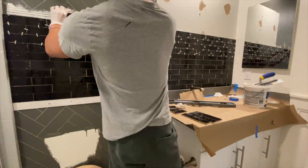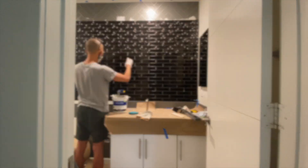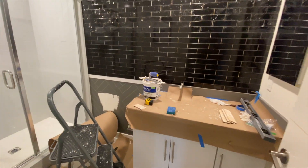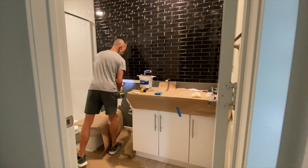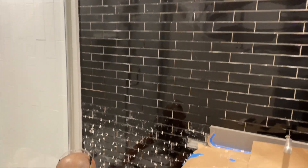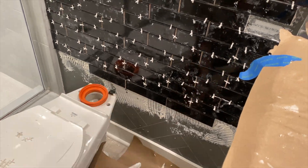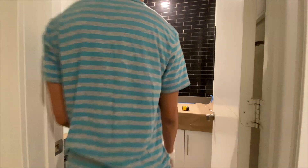When laying down the tiles I apply medium pressure — enough to feel them sticking to the wall. I was worried about unevenness, but I made sure everything was level after every two or three rows. It's also important that the wall is flat — it doesn't have to be perfect; I didn't even patch the wall after removing the mirror, but it was workable enough not to affect the tiles. Once the top half was done and the first few bottom rows dried, I removed my straight edge to work on the bottom half. Starting from the top with no ledge, I had to work fast, going back after each row to make sure the tiles didn't sag.